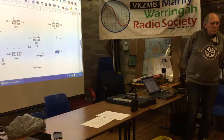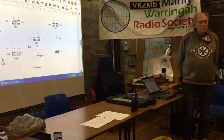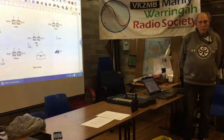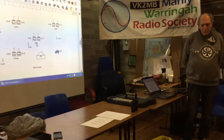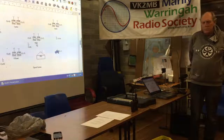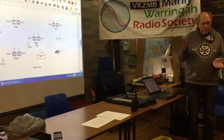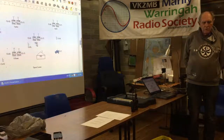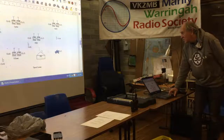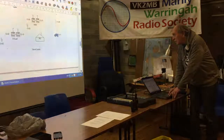The VHF frequency is 77 MHz. We've got two pairs on 77 MHz, four pairs on UHF, two portable pairs on VHF high band, and about three or four frequencies for fixed on high band — quite a few frequencies around the place. We don't use CB. The UHF frequencies are 473 and 479 MHz for the split — they're above and below CB but not on CB. You get problems with CB users even when you're not trying to do something, so we avoid it.